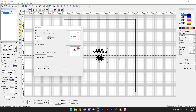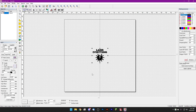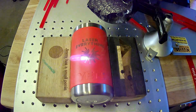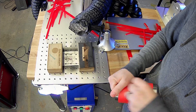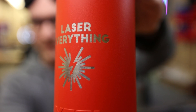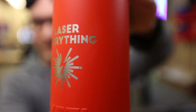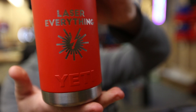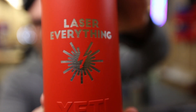Just to show you guys, we can do this with the 30 watt Mactron as well. We're just going to come in here and increase our power to 95% — we are on the 30 watt here, so we need to bump that way up. Our speed and frequency are going to stay the same. Focus is the same. Everything else is going to be identical. With that marked, we're going to give it the same exact cleaning treatment with alcohol and a little bit of Zep to shine it up. And here are the final results. This was with the 30 watt Mactron. It's actually going to be a little easier with a lower powered laser, believe it or not, because we don't need to worry so much about ablating the metal — we've got even less power behind that large field size lens, and that means less of a chance that we're going to ablate. Pretty great results there.